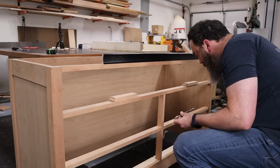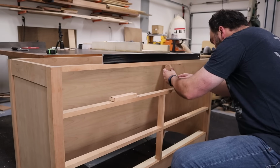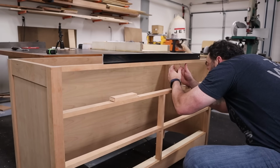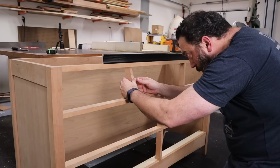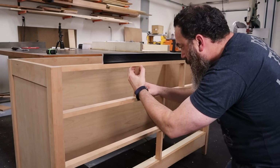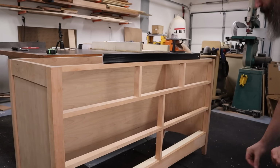The bottom rail on this dresser is rigid, so I'm using that as a starting point, and I'm working from the bottom up to the top installing these dividers. Using a straight edge as you go ensures that you aren't creating any bow on the rails. Any bow will cause issues with drawer alignment and uneven gaps later.